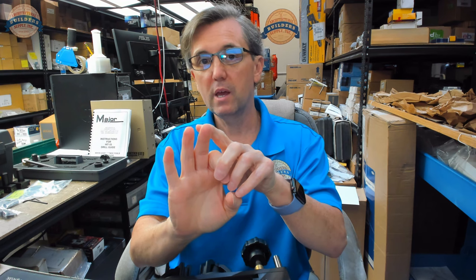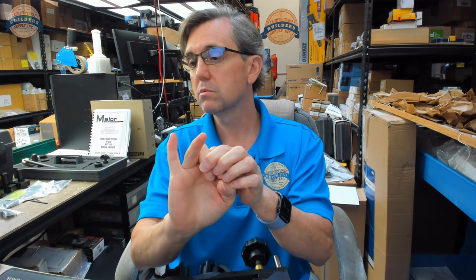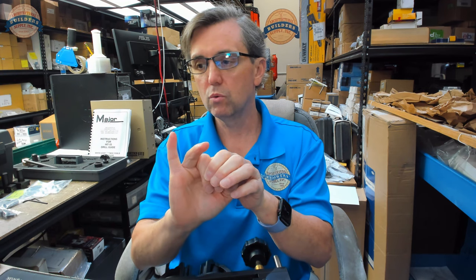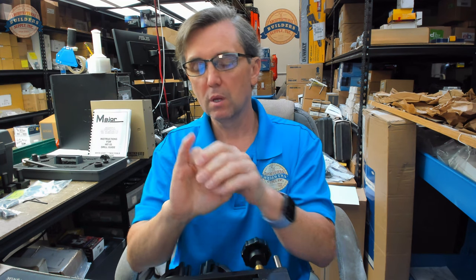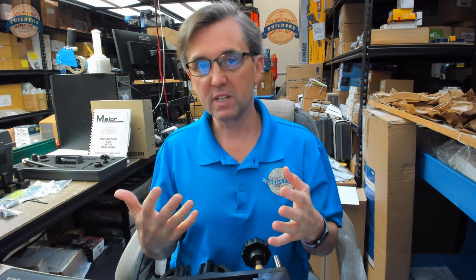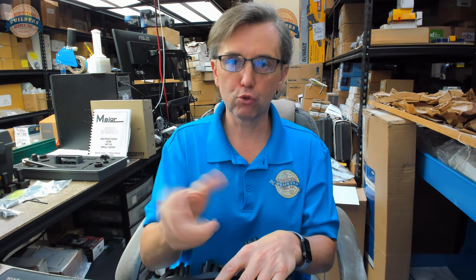If it's a fire-rated door, you're going to want three things: a second person, a shop vac, and you are definitely going to need the ability to clean the tool. Fire-rated doors, assuming that it's permissible for you to drill the door in the first place. I'm speaking to people who are permitted to do it. Drilling a fire door in the field for a deadbolt would technically be a violation. If you're a licensed shop that is permitted to do it, as we have been, you want that person and that shop vac to capture that mineral core as you're drilling it. Absolutely, no questions asked.